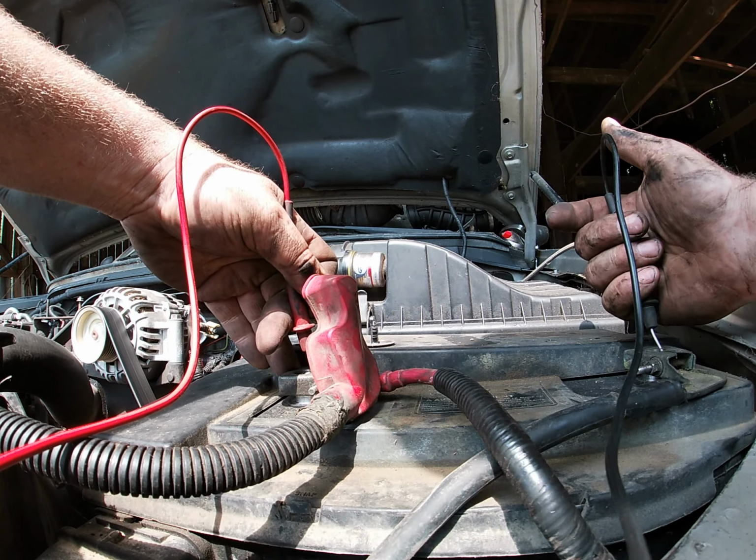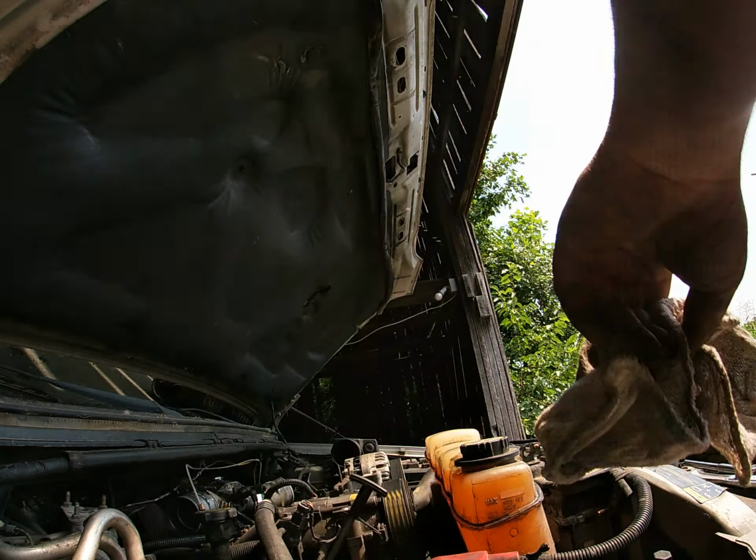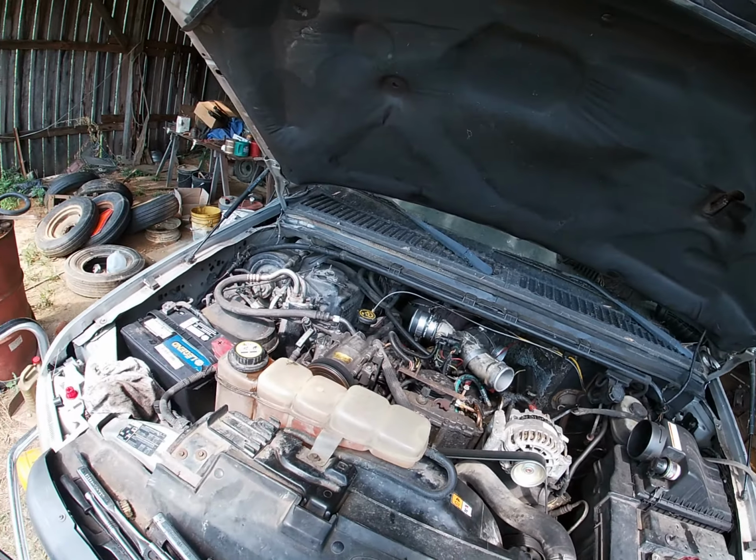See here. Now the compressor's cycling quickly. That's not good. Okay. So it's just slow to kick in like the other ones are because the glow plugs stay on, right? Glow plugs run 90 seconds whether they need to or not. I know that valve cover is not bolted down all the way, so it's getting some smoke out of there and stuff. That's perfectly acceptable at this point in time. We're getting blow-by out of the blow-by tube also. Perfectly acceptable at this point in time.